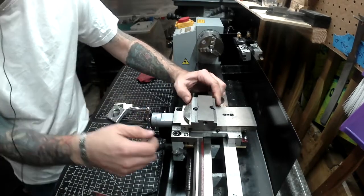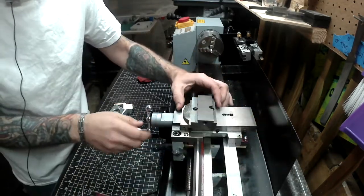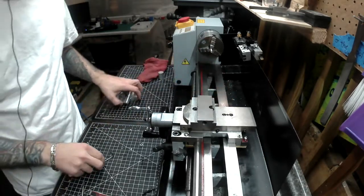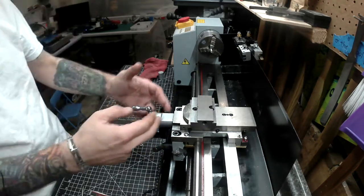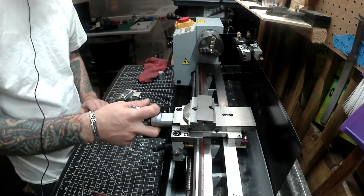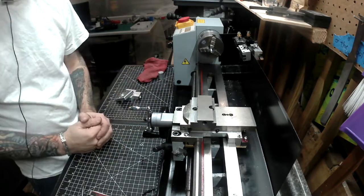There's a little bit of backlash in here. The gibs themselves look pretty tight - it all slides pretty good, there's not a lot of side-to-side play. There's just a little bit of play where the lead screw meets the handle. As I look at the diagram for the CNC parts, there's a thrust bearing and some other stuff that lives between the motor and the lead screw, so I'm thinking I can probably take a lot of the backlash out in there. That's pretty much it for this upgrade. Thanks for checking out this video. If you haven't subscribed to the channel yet, please do and stay tuned. See you soon.